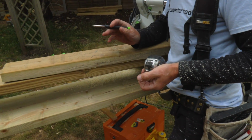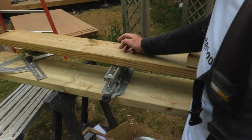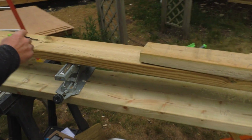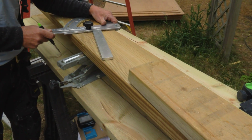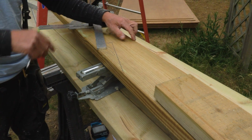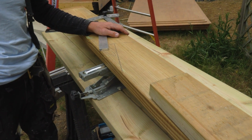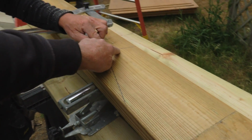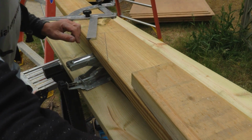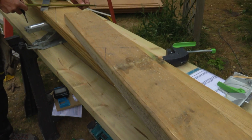Oh, right. It's not a lot of difference, but it does vary. And you've always got to measure it on this plumb up there, because this is where the two roofs sort of meet in the plane there, not square, but plumb down. Got it, okay. So measure along your plumb line. Down the plumb line, which is the same as that. That there is 97mm, and I've got 97mm on there.